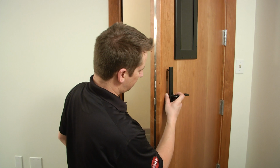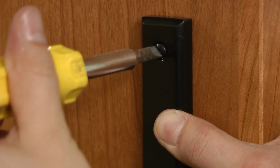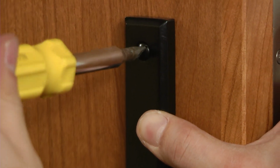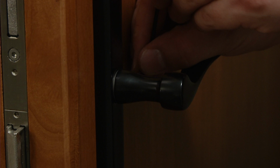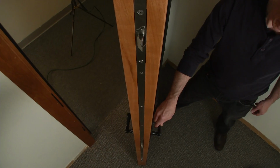Place the door handle levers, spindle, and plates on both sides of the door. Use care with the screwdriver on the powder coating. Tighten the handle with the hex wrench and check the latches for any binding. All 3 latches should work smoothly.